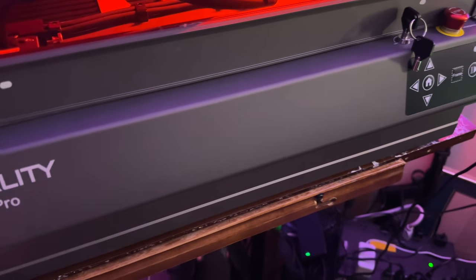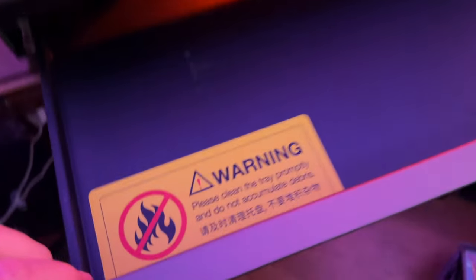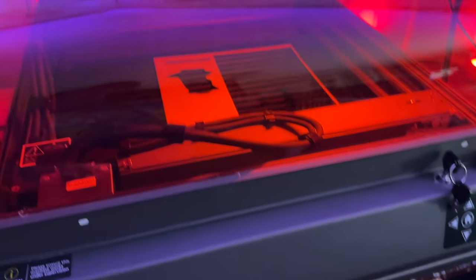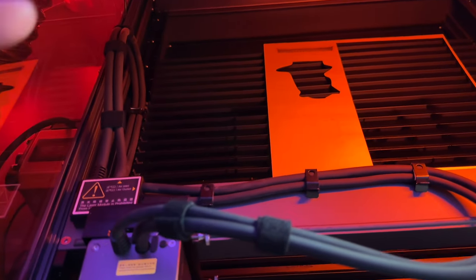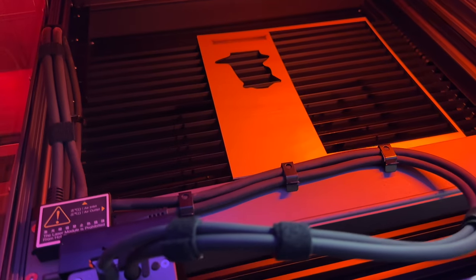For cleanup — you can see some of the debris that accumulates below after you've done some cutting. The drawer comes out and you can clear all the debris. It's important to clear stuff out because as the laser shoots down, it can actually cause a fire. Cleaning this out is very important. The tray says 'please clean promptly — do not accumulate debris because it will cause a fire.' Now, if you do have a fire, there are sensors on the inside that automatically shut the laser off. And if it accumulates too much smoke, it will also shut the unit off. Very cool safety features.